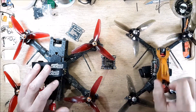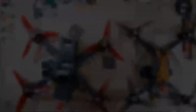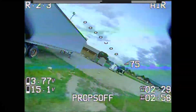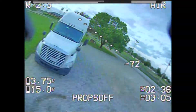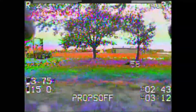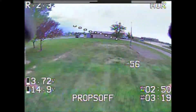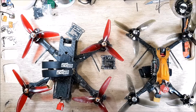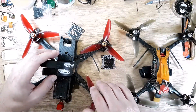Now this one still has the flickering OSD issue. You can see here looking at the OSD information — props off — it just flickers a little bit, just bobbling the throttle. Fighting the wind, you'll see it full on, just missing in action. Buttering the throttle, fighting some wind, and you can see it flickering away. Watch this — full punch over this tree. Do you see that? Just flickering and then it goes away on that punch. That's unacceptable.